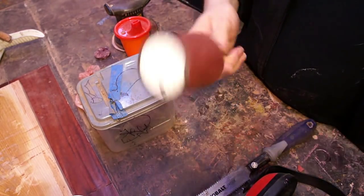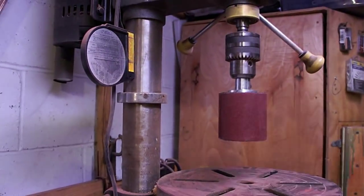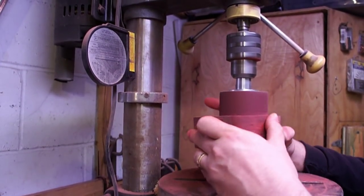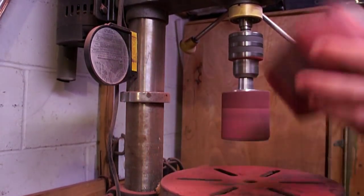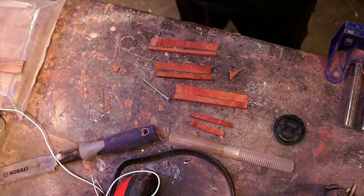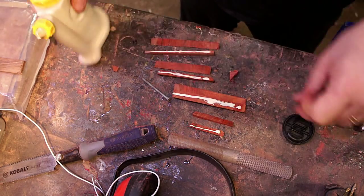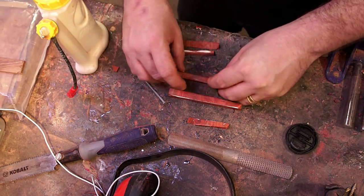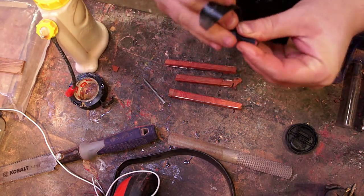Let's see how the bottoms turned out. After I got everything together there was a little bit of glue in the joints and I wanted to make the inside a little bit more round. It didn't have to be perfectly round but I didn't like how the big flat surfaces looked when you opened up the top. So I found the biggest drum sander I had for my drill press and went to work on it — it made pretty quick work of it as long as you have fresh sandpaper. Those are the little overhangs I cut off with the saw before taking it over to the belt sander. At this point I didn't know I was going to use them on the project — I was setting them aside for something else, but you will see how I end up using them later.